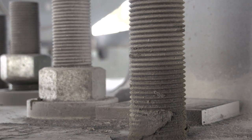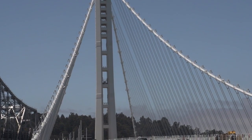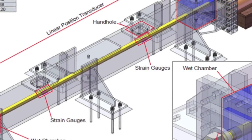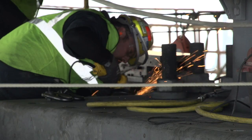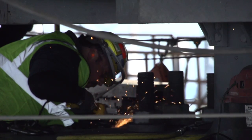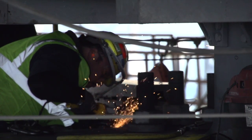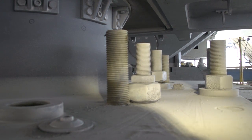Pier E2 bolts are being tested first. Other bolts and rods from other parts of the bridge will also be tested. There are four outcome possibilities based on the test results: the bolts may be left alone, or the tension on them could be reduced, or engineers could provide more dehumidification to reduce the chance of hydrogen embrittlement, or finally, the 2010 bolts could also be replaced as part of a long-term maintenance project.